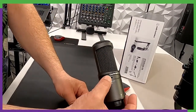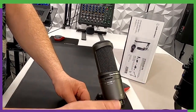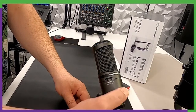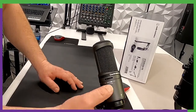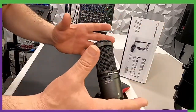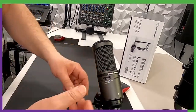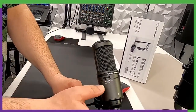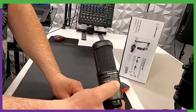And what that means, you get this little wheel here, just like you do on a lot of the good microphones. So if we're playing this right into our computer, which is what we're going to do, we're going to go from what they call COM, which is an old school, real technical term for the port, the computer, we'll say, make it nice and simple, what we have going on our computer versus live on the actual microphone right here. So you can blend that between the two. So if I'm using the computer for backtracks, that sort of thing, I can have it closer to the COM. If I need to hear my voice more predominantly straight up on the microphone, I can do that here. This is also how you get rid of the delay in your actual voice. You want to be listening to yourself directly from the microphone. And if you're playing back, you want to go straight to the COM.